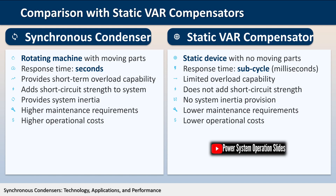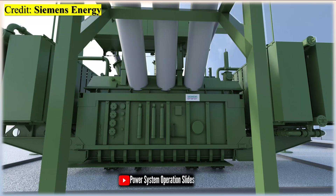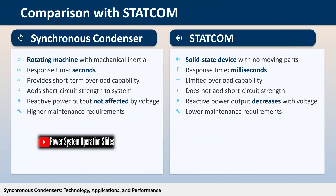Compared to capacitor banks, synchronous condensers offer several distinct advantages. While capacitor banks are cheaper and more efficient, they provide reactive power in discrete steps rather than continuously. The reactive power from a capacitor bank decreases with voltage decrease, while a synchronous condenser can increase current as voltage decreases, making it more effective during voltage sags. However, synchronous condensers do have higher losses than static capacitor banks, typically consuming about 3% of their reactive power rating as real power. Capacitor banks are also more modular and can be deployed at multiple locations economically, whereas synchronous condensers are typically installed as larger, centralized units.